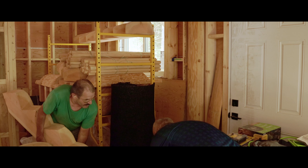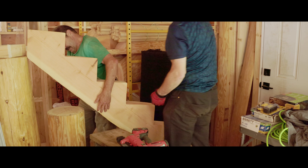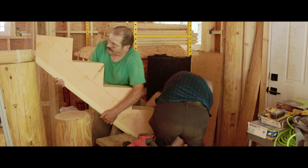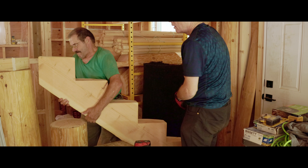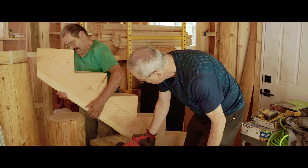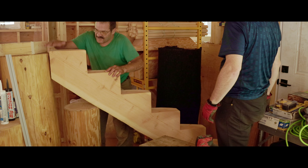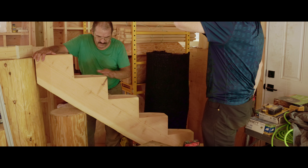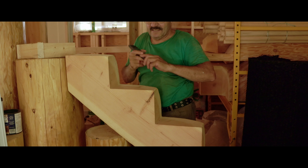The stringers are made from Douglas fir and they are quite heavy to move around. What we need to do is set it up and prepare everything and measure everything so we know exactly the height of the landing. Before we find the height, I'm going to make sure it's level first. Because I used 2x10 instead of 2x6, it's therefore just higher.